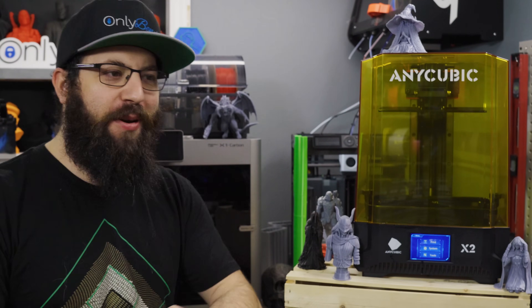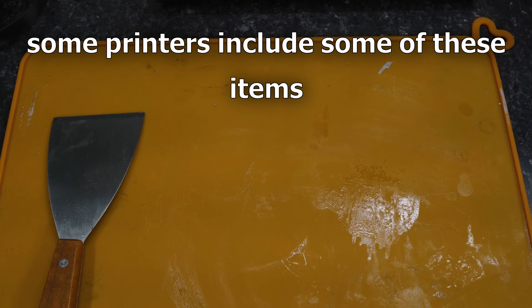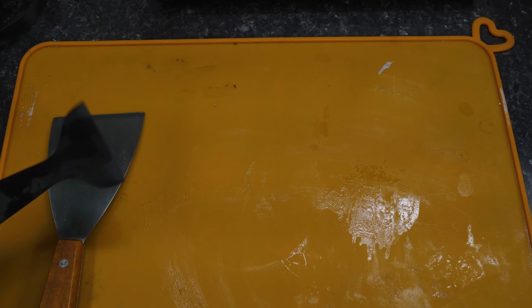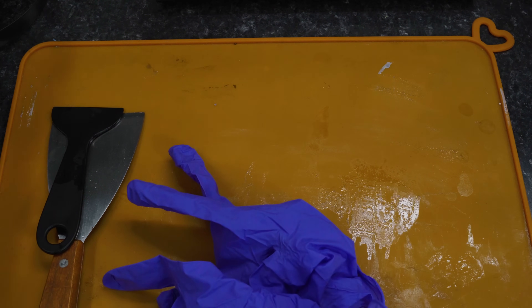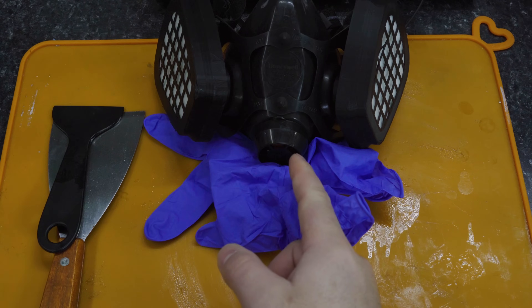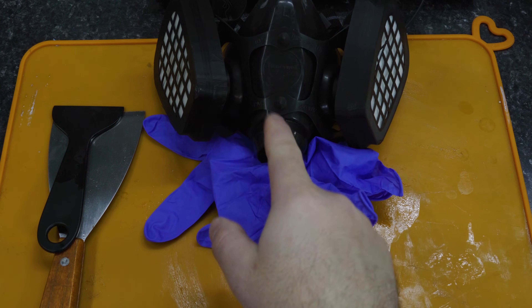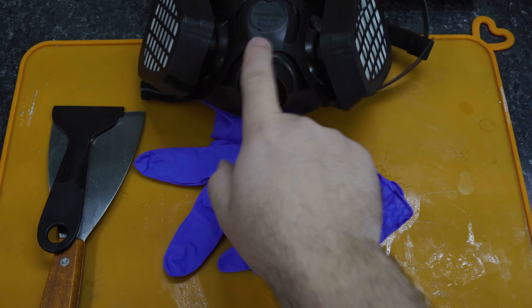So first off, you've bought your printer and you're ready to print — no, you need to do some more shopping. Did you get all your gear and consumables? We need to kit out like it's a World of Warcraft raid. You're going to need a silicone mat to make sure any spills don't damage surfaces — this also makes cleanup really easy. You're going to need some spatulas: some to get parts off your print surface, and a soft one to squeegee off excess material still in your resin vat. You're going to need gloves — a lot of gloves — because you're going to get resin all over them and you really don't want it on your hands. It stinks, and you're going to want a mask too. That COVID mask that's been in your jacket pocket for two years is not proper — you're going to need something that can handle the vapors and organic compounds that resin off-gasses.